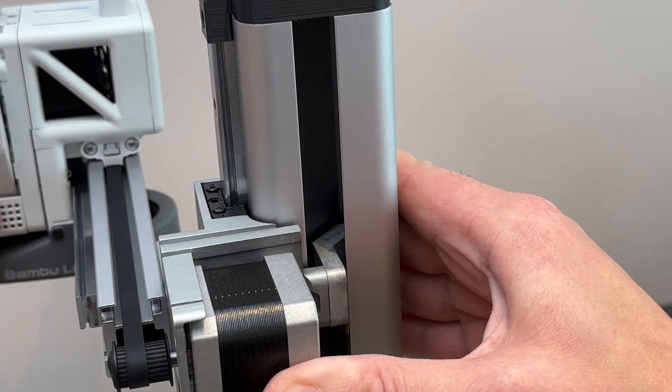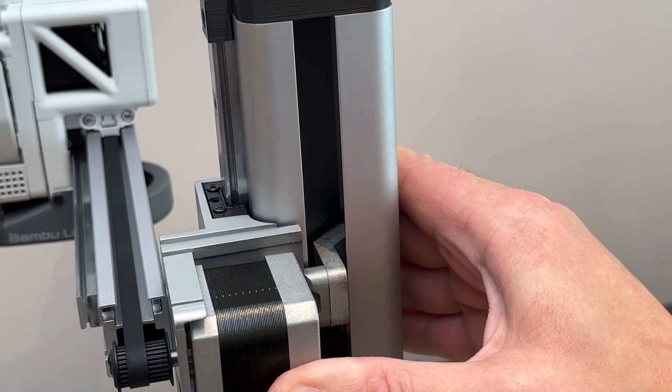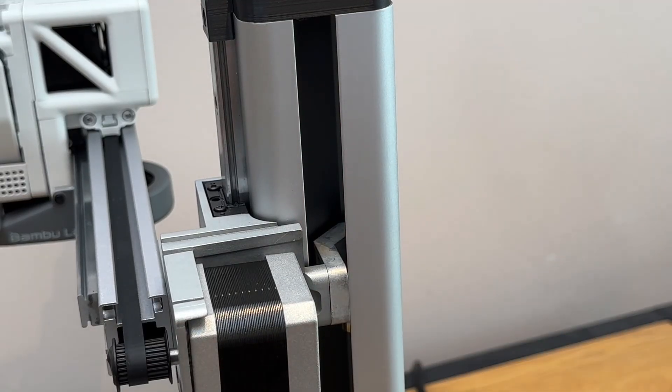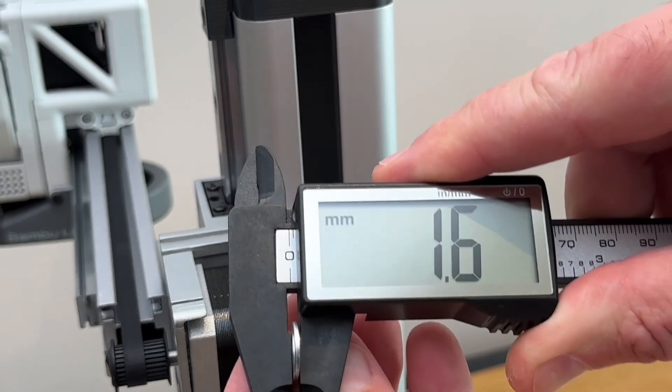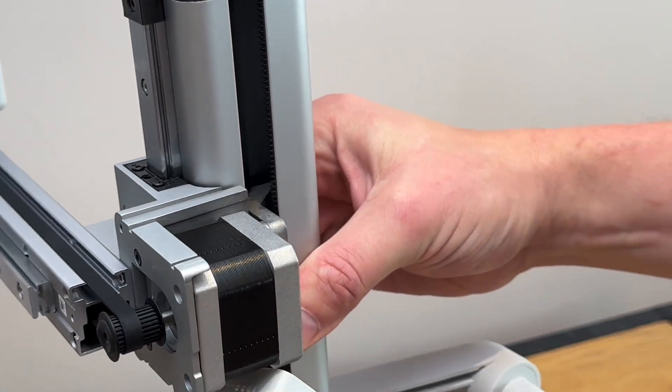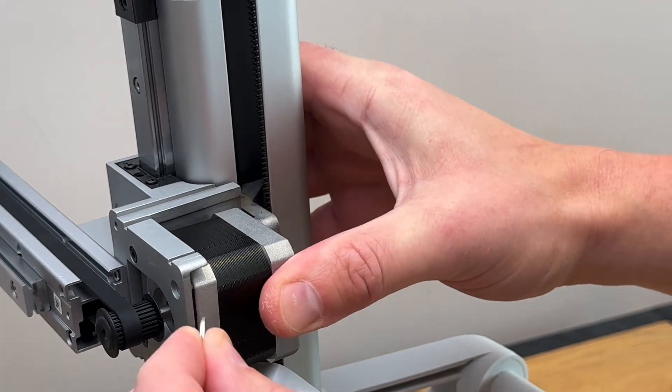As you can see, it's staying relatively straight. I'm looking at at least a washer of that thickness, which is probably about 1.5mm. Just get the calipers — the larger washer is 1.2mm, which probably isn't enough, but we'll try it. I have another smaller washer; two together measure 1.6mm. What I want to do is try and get that between the plate and the motor.